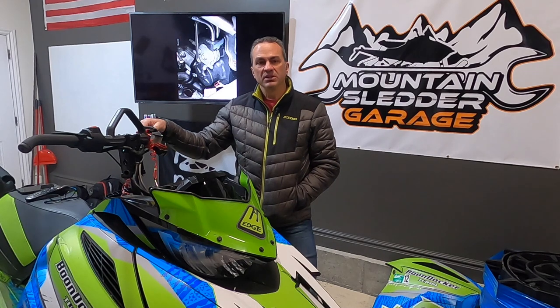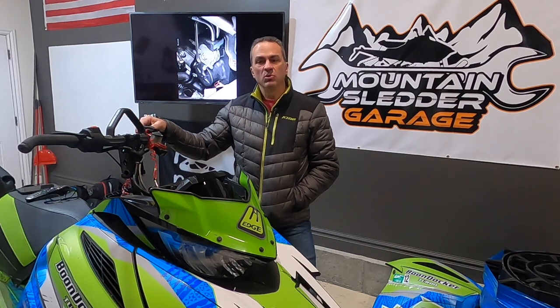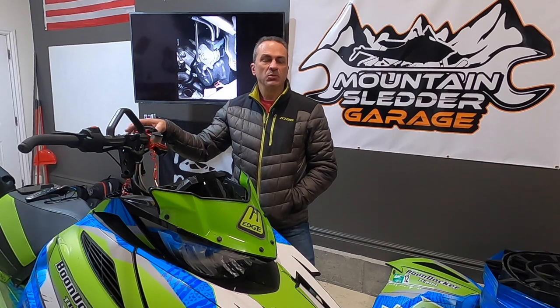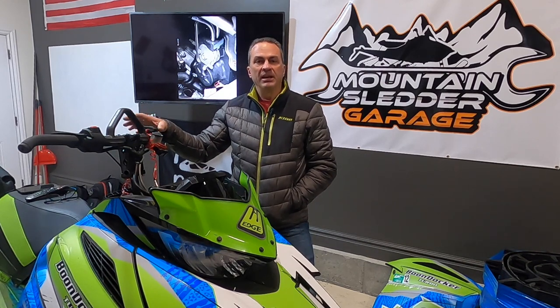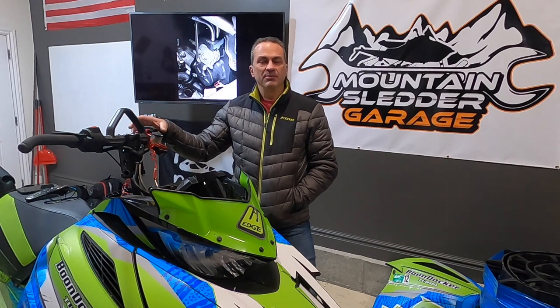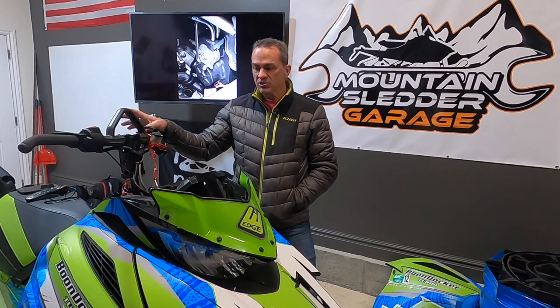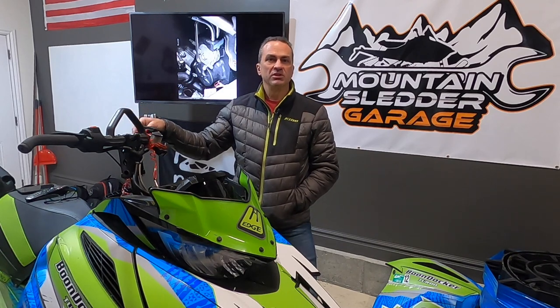In this episode, we're going to talk about a problem we're starting to see more and more of on the 20 and the 21 Arctic Cats. The problem is, in 2020, Arctic Cat changed their servo motor and the servo motor pulley. If you look through the microfiche, it looks like some of the Arctic Cats got the old style servo motor and some got the new style. But when I look through the 2021 microfiche, it seems like all the 2021s got this new style servo motor, except for some of the dual rail sleds that were shipped over from Europe.